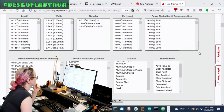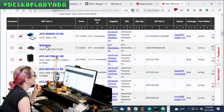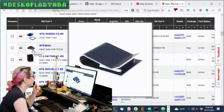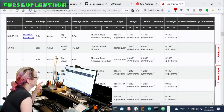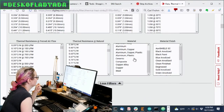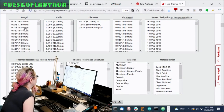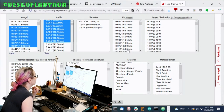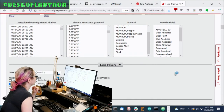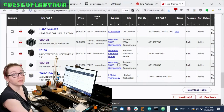That covers most of them. These are the clip-on type, which I don't want — those go onto a TO-220 or something, they're really cool but I can't use a clip-on type. So I want one that isn't a clip type. We can filter by length and width instead — I wanted something between about eight and up to maybe 11 millimeters. That really cuts down the numbers; there aren't that many small heat sinks since most heat sinks are for large chips.